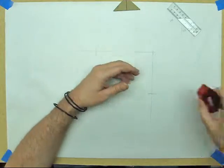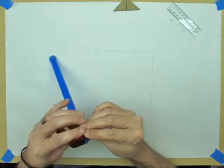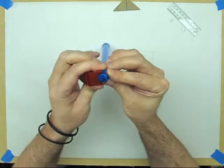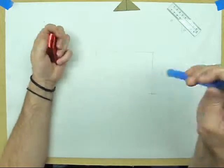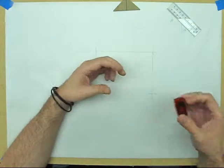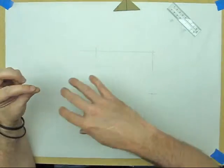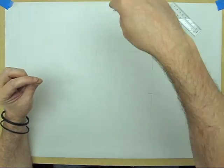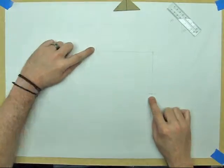As I mentioned earlier, the mandrels themselves have centerline capabilities. I don't know if it'll show up in the camera, but this line right here is the dead center of the tube, so you don't have to guess. Anytime you're measuring anything in the machine to get a dimension, you just measure from the center of one fitting, no matter where the other fitting is. After you've done your loop planning, you measure to the center of the other fitting. And that gives us these dimensions right here.